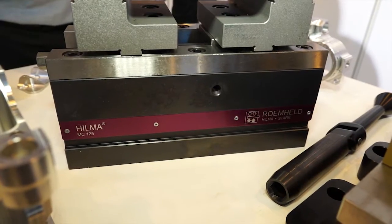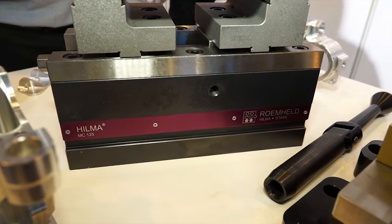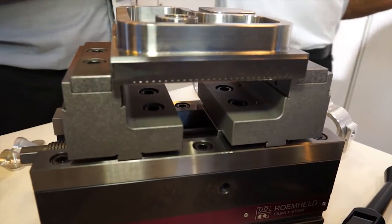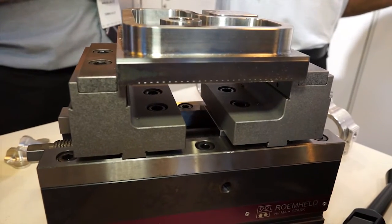What about the actual gripping — is there a pull-down motion, serrated jaws? The jaws are primarily designed with a special serrated design that gives pull-down as well as clamping force. On the other side of the jaw it's smooth, so you can turn it around for the next operation without doing any damage to your finished component.